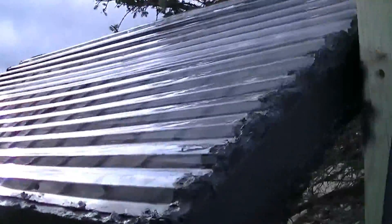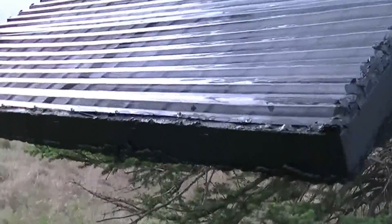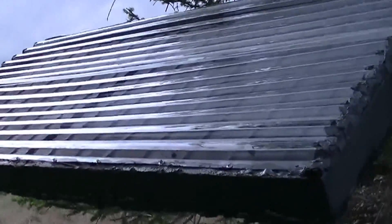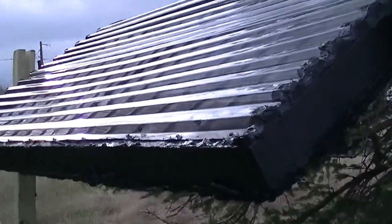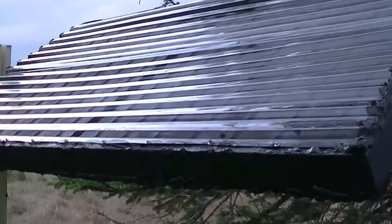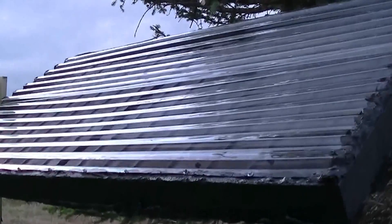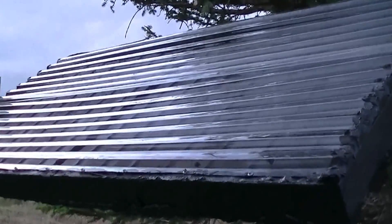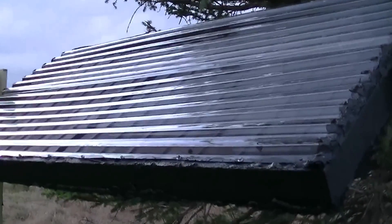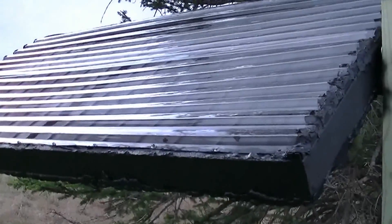That's basically a risk you've got. Apparently these solar thermal collectors are a lot more forgiving in terms of the solar angle compared to PV — you can still get a lot of the gain even if you're off the angle a little bit. So it might make sense to go with a more vertical angle for more winter gain when you want more of the heat. For now I'll play around with it and make it adjustable to get the most out of the sun. Next we'll take a look at some hookups to the soaker tub.